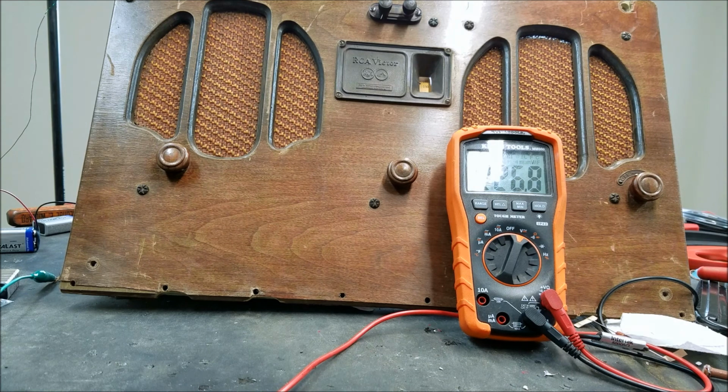I did check. I couldn't find the data sheet for these particular batteries. I checked Energizer's data sheet for theirs to see if they had any maximum currents or anything. All I found was a bar chart that I think went from like 25 milliamps to like 100 milliamps. So apparently that's the expected operating conditions for those, 25 milliamps to 100 milliamps. But for these ones, it can't even put out 9 milliamps without dropping precipitously. So I'm really not sure what the deal is.